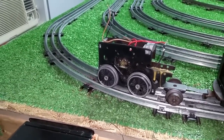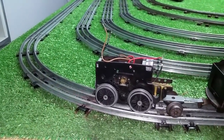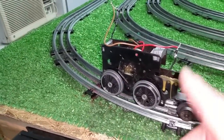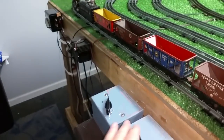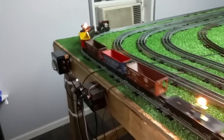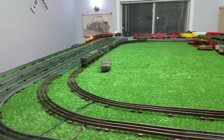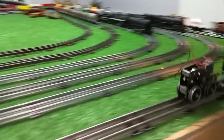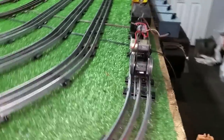The circuit board has an integrated circuit on it and the electronics were gone — it just wouldn't do anything at all. So all I needed was two diodes. Rather than having to order them, I just tried to scavenge them off of the original circuit board, and this was the result. I haven't even soldered them — I've just got them twisted around the wires. So it effectively converts AC into DC and allows you to run these can motors on standard track power.